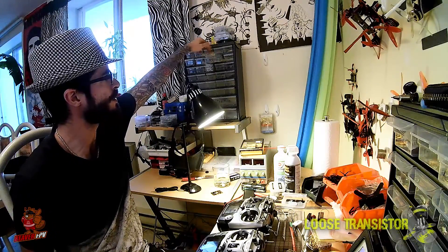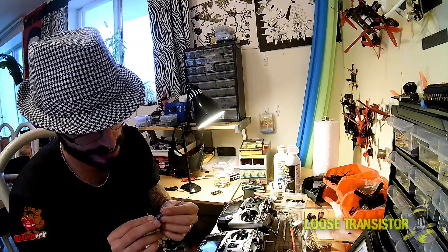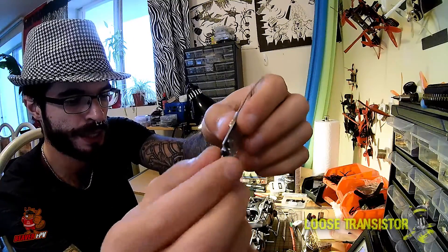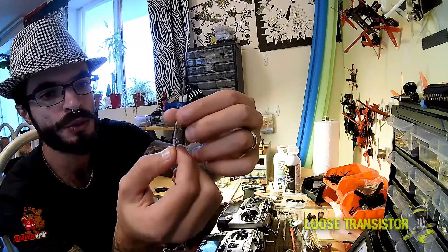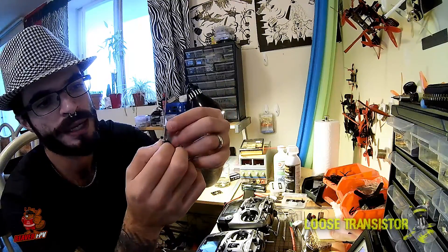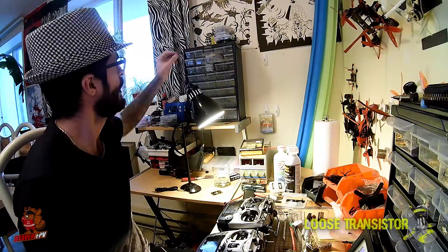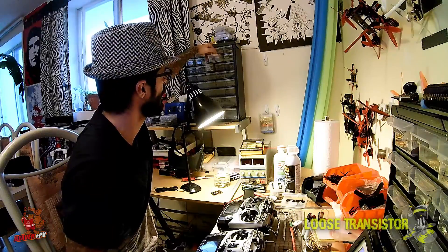The other receiver RadioLink now supplies is the R6 DSM — this tiny little guy right here. It's smaller than my thumb, has just an S-bus output, and was designed for the micro quad world. I want to run some tests to see if it works in a bigger quad too, but I'm concerned a single-pole antenna without diversity might not perform as well as a dipole. This will be going on my Doinker build, so you can look forward to a Doinker build video coming soon.